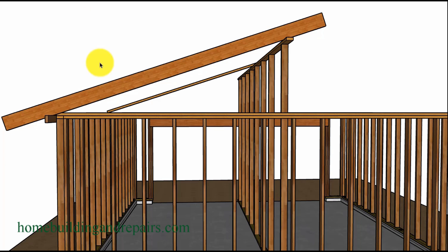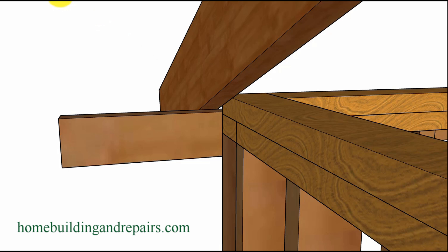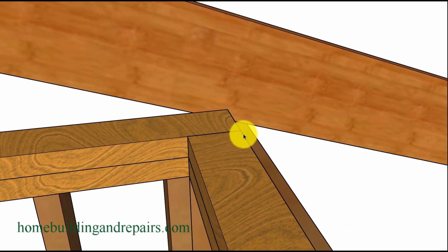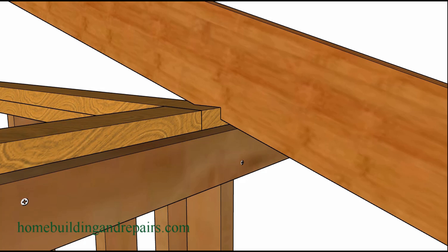To keep things simple, I am going to nail a block onto the side — or screw it onto the side — about an inch to an inch and a half down, and just simply set the rafter up there. We're going to use this so that we can mark the bottom seat cut. You can always use math for that. The seat cut, as you can see it's up against the wall here, can be the full length of the wall, but try not to have it any smaller than two inches. You can have it between two inches and whatever the thickness is of the wall. If it's a two-by-six wall, you might not want to go the full five and a half inches — three and a half inches would be sufficient. Here's what it would look like after you marked it. Double check it by setting it in place to see if it fits.